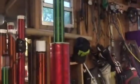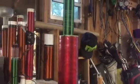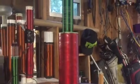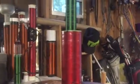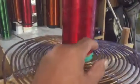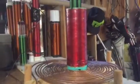So the experiment I wanted to do is go to Tesla's old patent, I believe it was from the Colorado Springs experiments, but to Wardenclyffe, and it was his tower, and he uses a secondary conductor, which he calls B prime. He shows a primary coil, then he shows C, and then he shows an A coil, and then he shows a B coil, and then he shows a B prime coil. So we're going to treat this as B and B prime off of C without A.